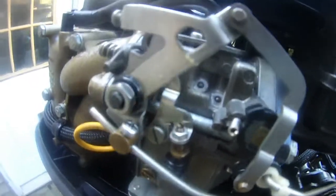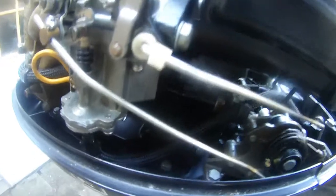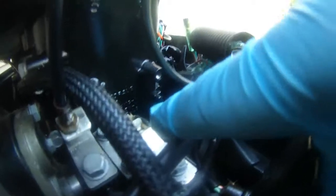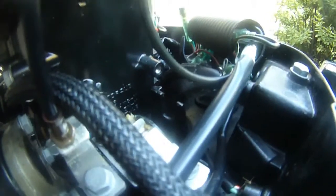So change the gear to forward now, and the link arm goes forward, push speed, go backwards, and then neutral, and then keep turning the tiller handle clockwise and then it changes to reverse. And then the throttle cable keeps going forward until it's stopped — that's the full throttle, full speed. Cannot go forward anymore, it will stop and then go backwards, and there you have it. And then stopping it, I keep turning, and then it will come back to neutral. So it's all controlled by this cable. If this cable breaks, then you cannot shift gear and you cannot control the speed of the motor.